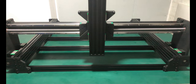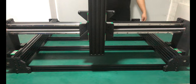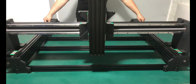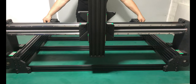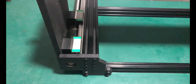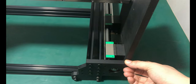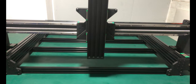You can turn the jaw coupler or ball screw to move the Y and A axis plates towards the front of your machine and only stop when the Y and A plates are touching the C-beam end plate. The machine will automatically align while doing this. If it's a long X axis, you may also need another person to help you. Double check if your machine is already square.